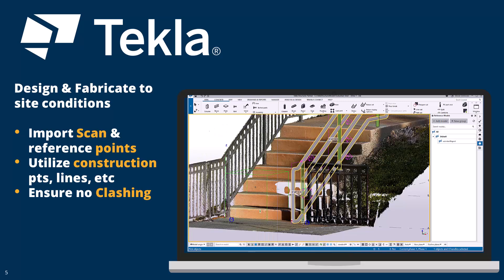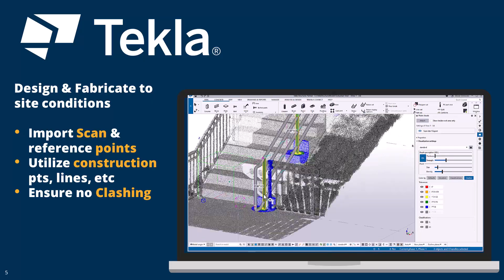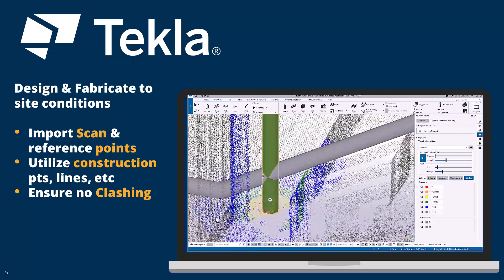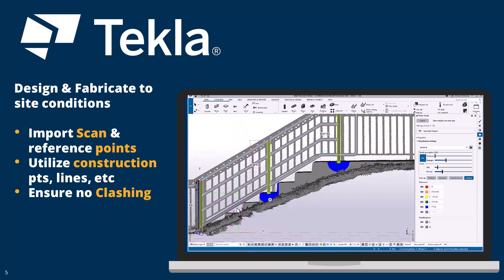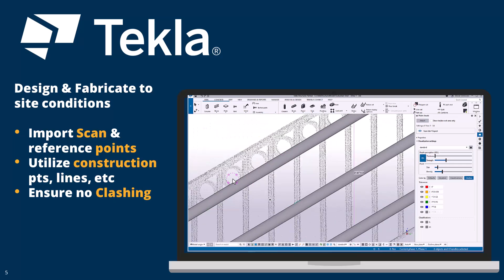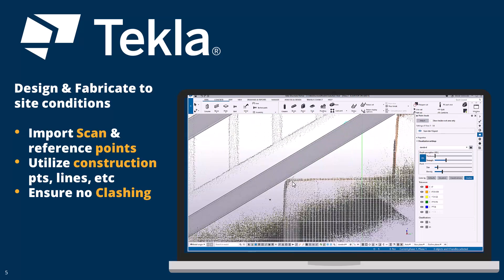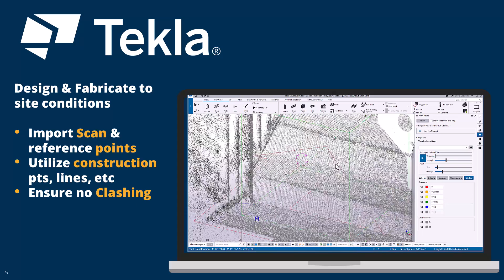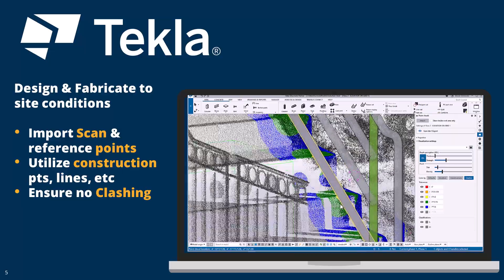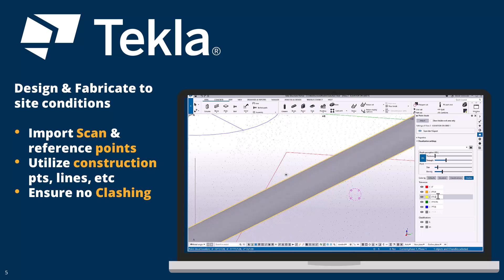Here you can see I can run a clash inspection and look at the different elements — actually colorize the point cloud for the distance it is away from the model. So I can start to generally view where that could clash. I didn't select that railing, but I can see that is obviously a problem when running that clashing. So I'll come back here and select it this way. That's what the clashing tool will do. You can see I can change that and start to see how close it is — it's actually within a quarter inch, probably too close for me to want to design something there.